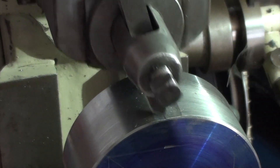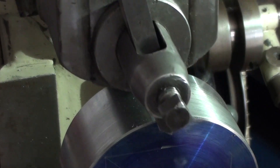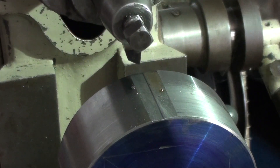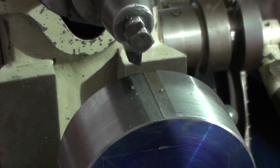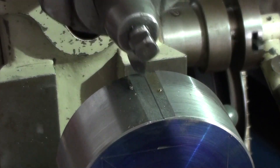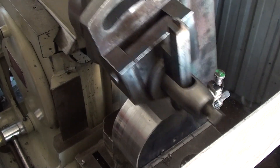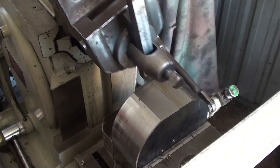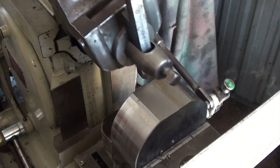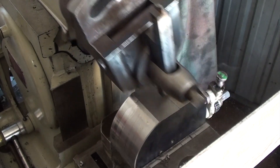We've made a start — first of many hours I'd say. I'm just feeling the way with the tool to see how it's going to go. I don't want to drive too hard; no point in breaking it. When I progress down in the next few hours I'll bring this back — it'll be a long night. A little update: I've put the shaper up to middle speed. It's a three-speed shaper with a three-section pulley — fast, medium, and slow. I counted the strokes over 10 seconds, multiplied by six, and worked it out at 61 strokes a minute.